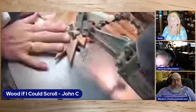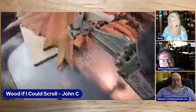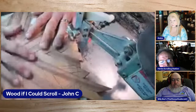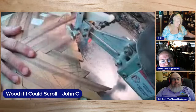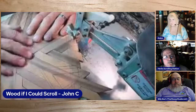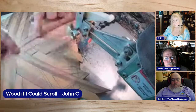In case anybody's wondering, I cut my, what am I gonna call this? I'm gonna call it marquetry background, my herringbone background. I cut this herringbone out of quarter-inch chalet cedar that I got a bunch of in my back shop. Basically I just cut my tongue and grooves off of it and sliced it up, and then cut all my individual angles on all of these.